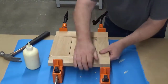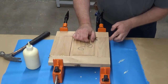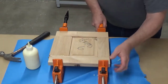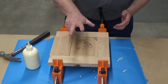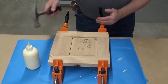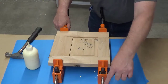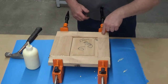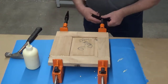Right now I don't have any clamp pressure on them, so I could in theory move them without the use of the hammer. I'm making these flush — I want the edge flush with the ends on both sides. Bring up the clamp. There are three settings: no pressure, snug pressure, and tight pressure. Right now it's just snug. I want to use the hammer to tap the stiles down so they're touching the bar of the clamp. If you have it tight it makes it more difficult to tap these down, so I only want them snug to begin with and then I can tighten them up from there.